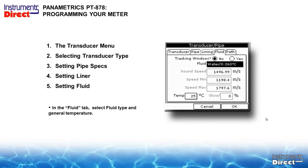Next, select the liquid by going to the fluid tab. It is a drop-down menu of different process liquids that will automatically default the sound speed. If you have a unique temperature situation, there is a place to plug in the temperature in the lower corner of the display. The device is generally accurate within plus or minus 10% of the sound speed. For HVAC applications with water and glycol, you can enter 30% glycol in the lower right corner. However, the difference in sound speed between water and 30% glycol at nominal temperatures is within that 10%, so in many cases you can leave the meter set to water and still get correct data.